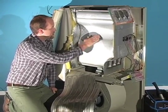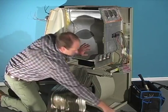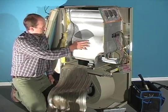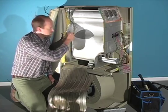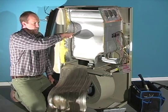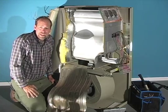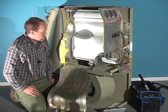And it's right here where this discolored area is. So here's where the burners are — remember the burner ports? The flames go inside there, the flames come up. This has been overheated, and it has deformed the metal and cracked the heat exchanger. It's in the back side here. There is no way you could visually see this. So be careful what you say about the heat exchanger as a home inspector — there's no way you can see this without tearing it apart.